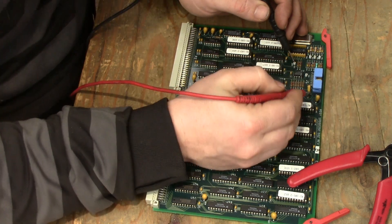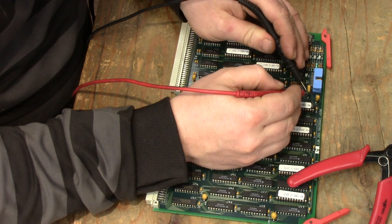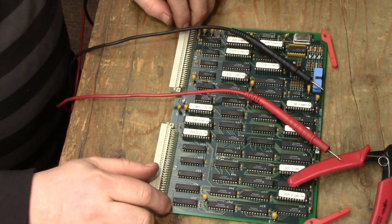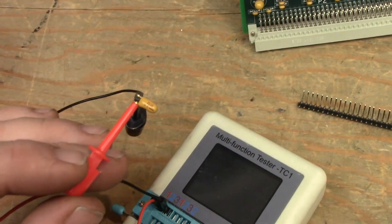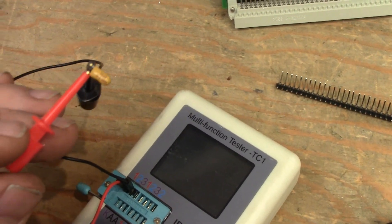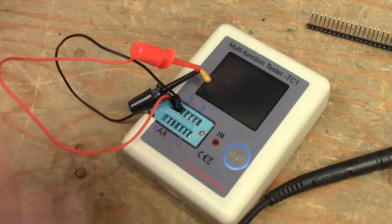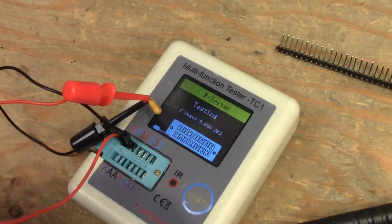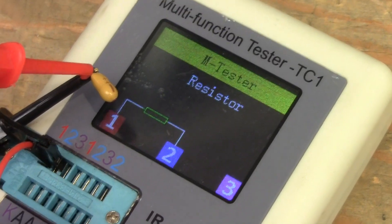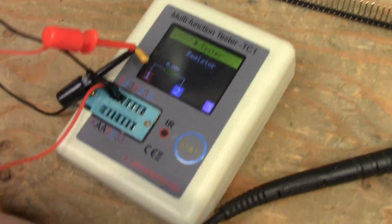Really? Ladies and gentlemen, that was it — I wasn't even trying. That was the tant. I'm not sure if that's going to focus, but it says 22, 16 — so I'm pretty sure that's 22 microfarad, 16 volts, polarized tantalum. And this is measuring 0.2 ohms — it's junk. I've clipped it out of there.